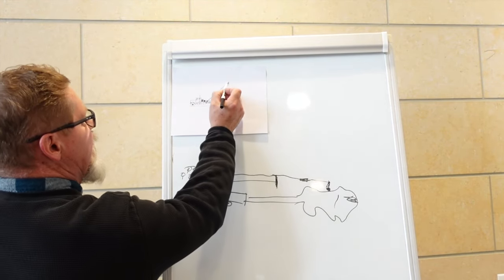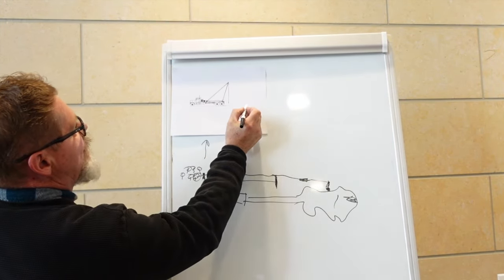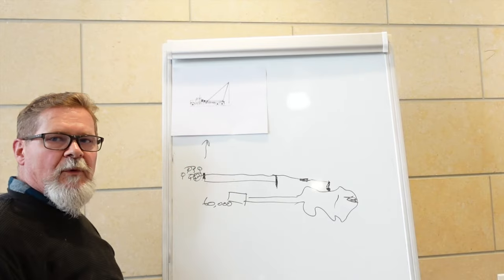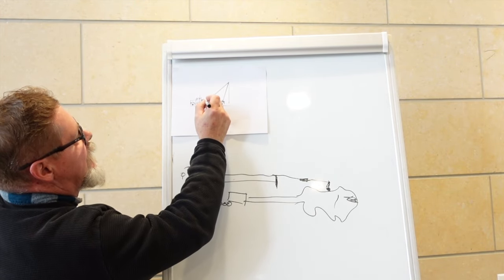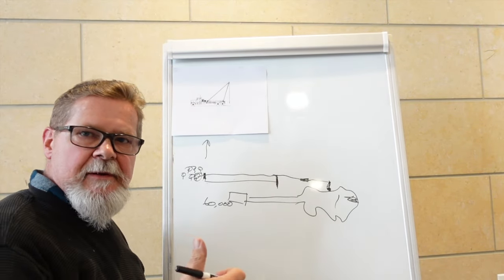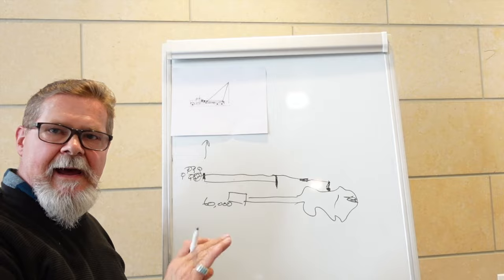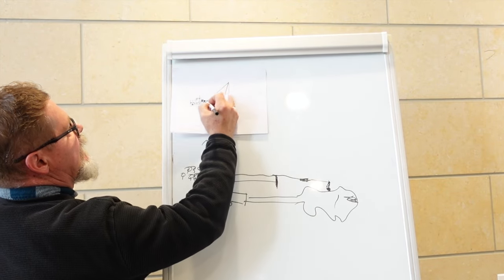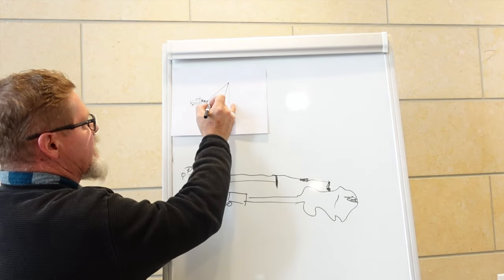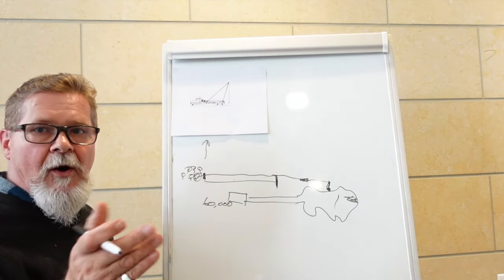So what they will tell you is you take the end of your line and you hook off to something out here that is heavy, then you run out away from it with your winch in neutral, you engage your number 1 winch, your big heavy winch, and you put the winch line that lets out slack on this, and you simply engage the winch, let this one run in reverse, this one run in forward, and tap your brakes, and the poles will raise up, and you adjust them where you want by putting the third winch, stopping it from going up or down, and then you're good to go.